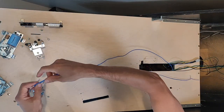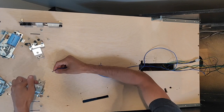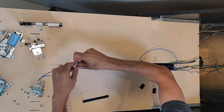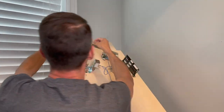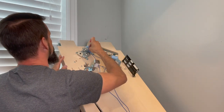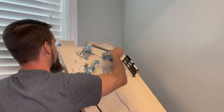Back over here. I'm actually gonna run wire power to my first slingshot over here first. It's a little bit harder to see, but there's a slight gray line on this side. So this is the one where I want power to come into, okay? And then I can have that one be the power for my other slingshot. And now I can come over here, and for my flippers, this is the one that has both wires, so I know that's my power. This one over here has both wires, that's my power.